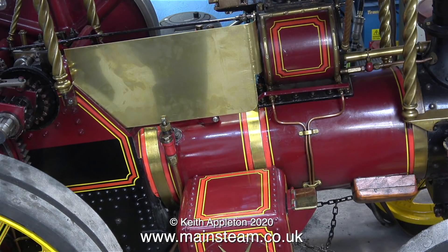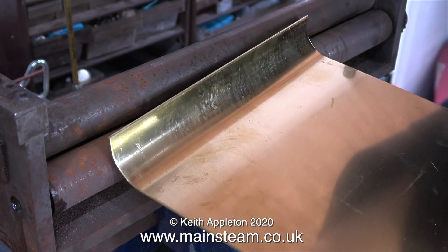I cut the first of the side plates to fit as you see here, and I cut out part of the curved bit at the front to clear the operating lever that opens and closes the drain cocks. In the last episode I showed how I created the curves on both of the side plates using my small set of bending rollers. I mentioned in the previous episode how important it was to make sure that the piece of brass sheet was fed into the bending rollers squarely.